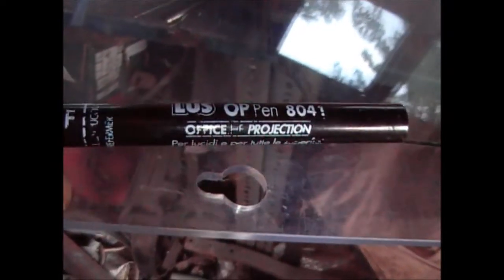I'm just going to use a very fine permanent marker. Obviously you need something that will mark the Perspex. Failing that, you can score it with something sharp, but it's much easier to see if you use a marker. So what I'll do now is mark round the sides of this piece of glass, then turn it around, because as you can see I've got this corner missing where it was cracked, and I'll draw the shape perfectly, and then cut it out with the jigsaw.